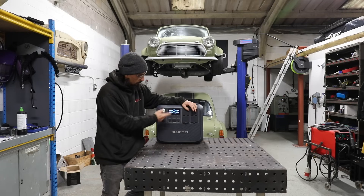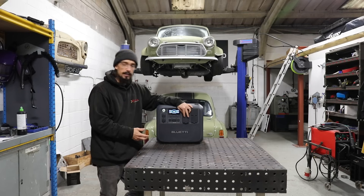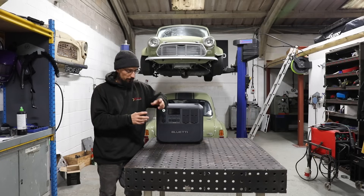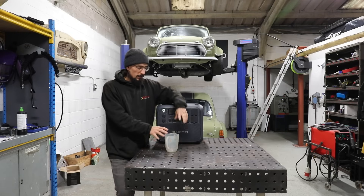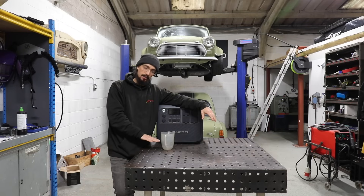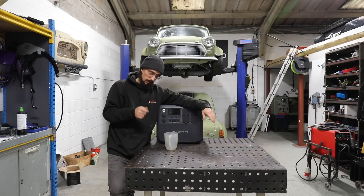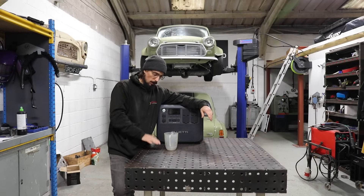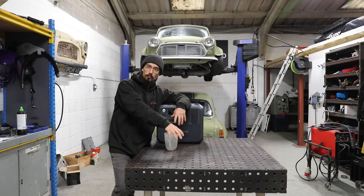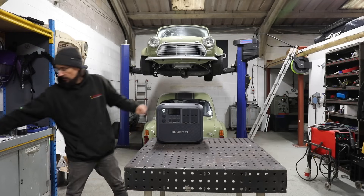I've got a full 100% charge. You can set whether you want it to do a fast charge, trickle charge, or normal charge. The best explanation I've heard: imagine a battery with all its cells as 20 pots lined up. When charging, the idea is to keep the level of each pot the same as it fills up. If you imagine the charger as a hose pipe, trickling water keeps all pots balanced, but at full blast you fill one while another gets nothing - so it goes out of balance. That's a pretty good explanation of charging batteries and cells.